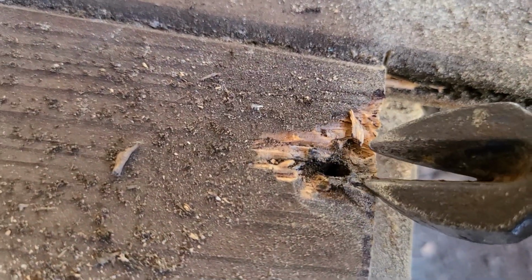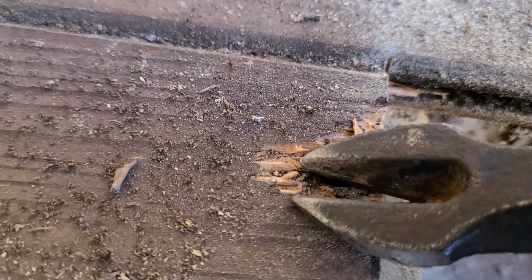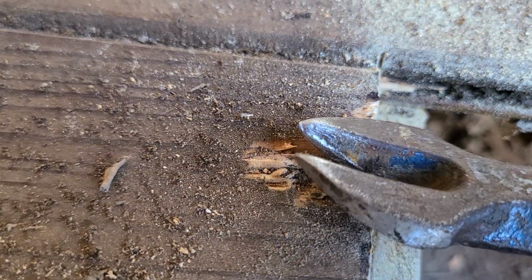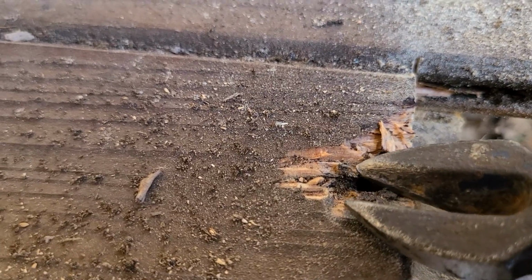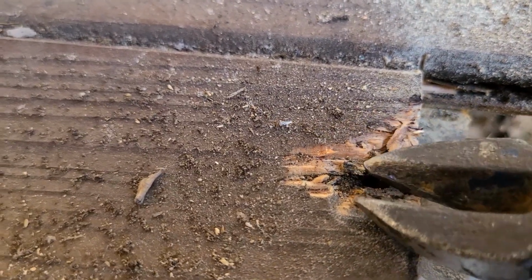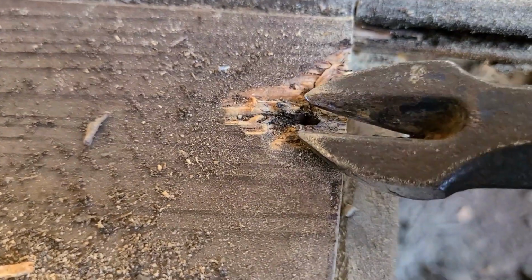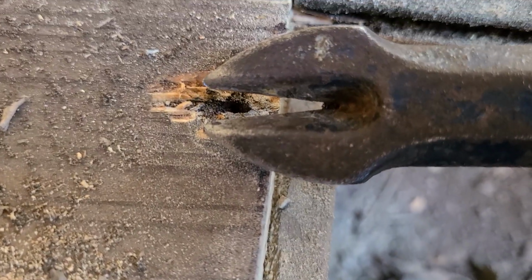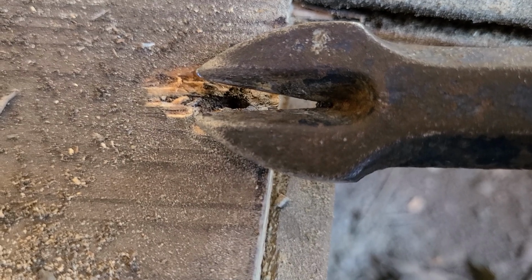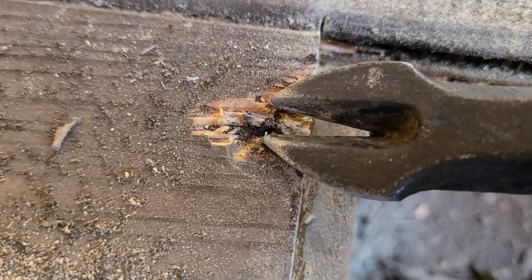When you come in to get this nail, and you get under it, and you tap on it, and it gets underneath the nail, then you pry it up, right? The more pointed that is, the easier it is to destroy less of the wood. If that's wider, you wind up taking a huge chunk of wood out of there, defeating the purpose. I've had some cheaper ones in the past, and you can heat them up with a torch and pound them a little tighter. But you do run the risk of detempering the material too. But that's just a little DIY trick.